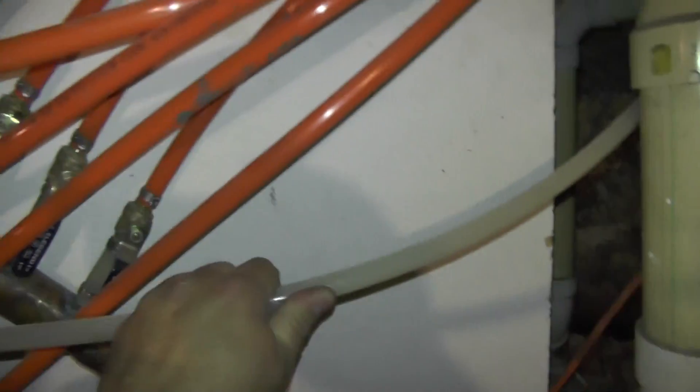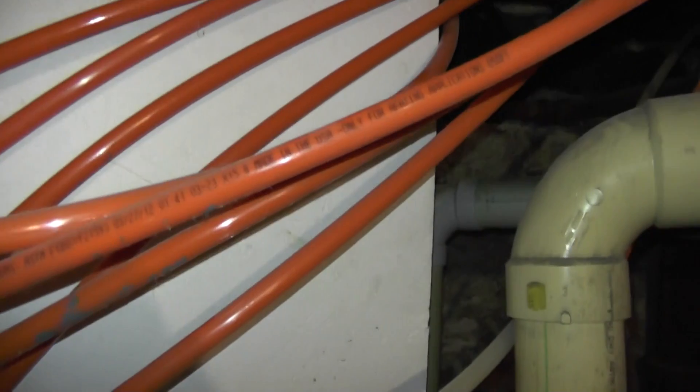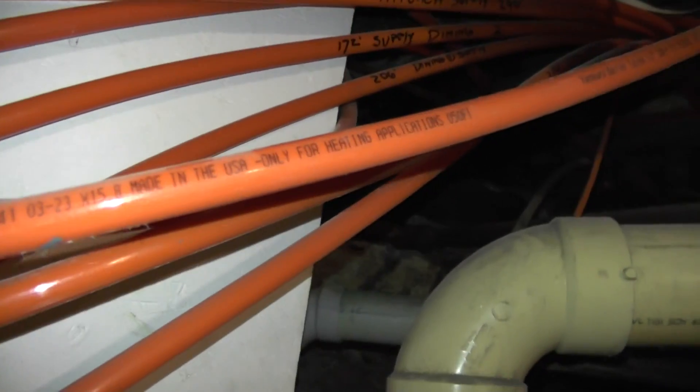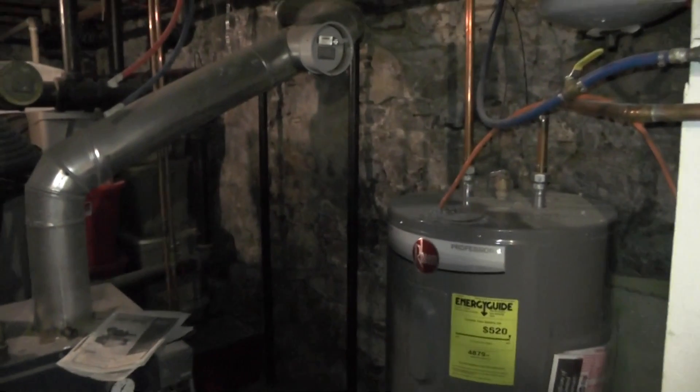So this is the clear PEX that you got? Yeah. These little pieces. I think there's some tubes — oh, you did run some clear PEX right here. Yeah, that's down in the basement somewhere. Which is better, the orange or the...? The orange is what you're supposed to use, they say, for the heat. But again, I'm not running the boiler at 165 degrees, I'm running the water heater at 120. So I don't know that it's worth the extra money for the orange, because you're not running it as hot.